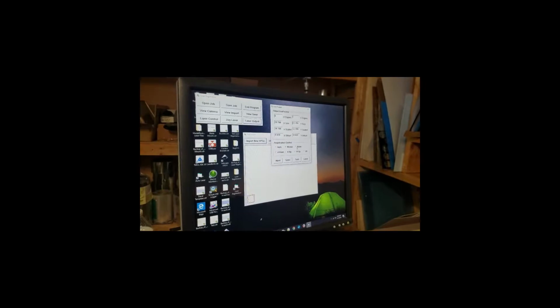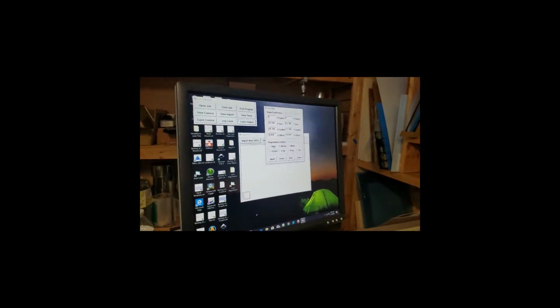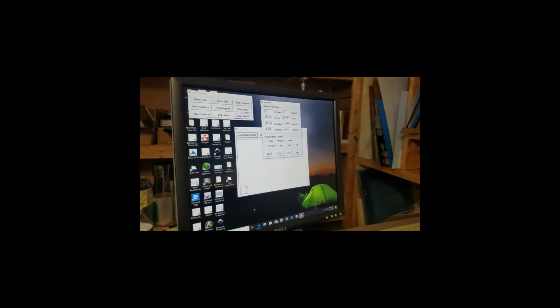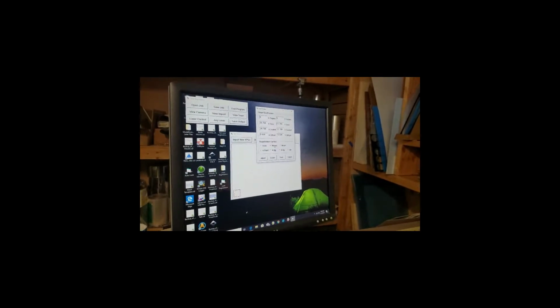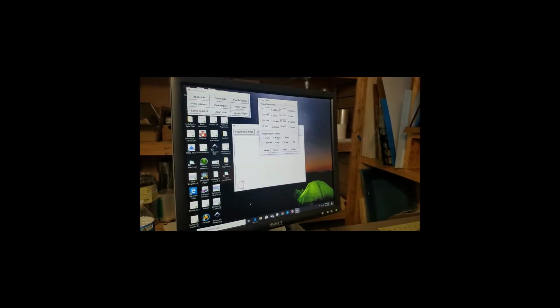Of course, there's none, outputting the job without any adjustments. There's a mouse registration, which is semi-manual, and then there's an auto registration. The auto registration will recognize objects, squares, rectangles, circles, and center on them if it can differentiate them from the background. But sometimes when you have wrong colors on the background or details running through the registration marks, you can't do that. So I have a semi-manual version called the mouse registration control, and I'll show you that method.